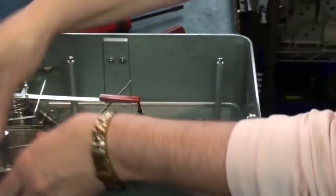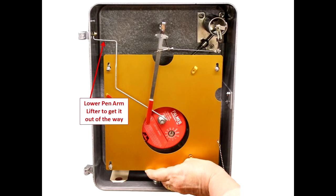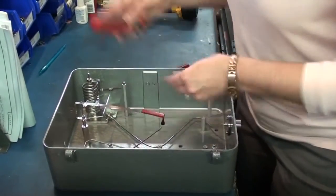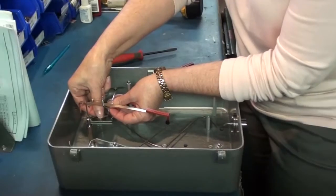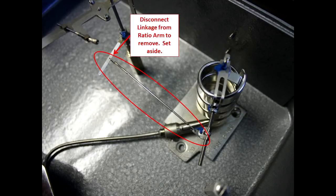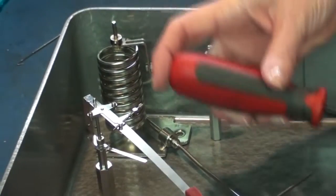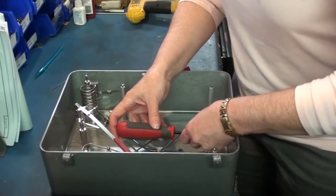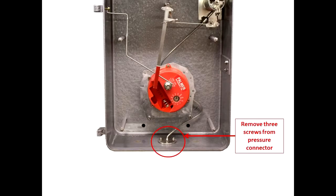Once we get that far, I usually like to move my pin arm lifter down so it's just out of my way. First, let's disconnect the linkage — we're just disconnecting the whole linkage from the ratio arm. Lay it aside. The bottom of the recorder has a connector with three 8-32 screws as well.